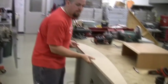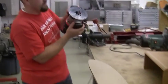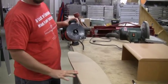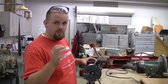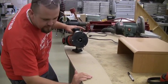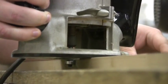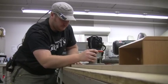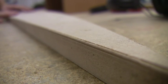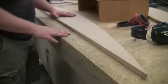But now, since you don't want to bend metal over a sharp edge because it will actually crack, we have this little router. We use a little router to put a 1/16th radius on the edge — which is the same as a 1/8th drill bit — so we just basically round off that corner. When you bend metal around it, it's got a round edge, not a real sharp edge, which hopefully prevents cracking the metal.